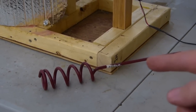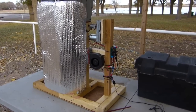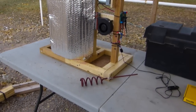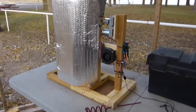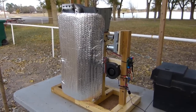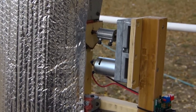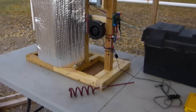These augers run counterclockwise, so you're going to have to hook the motor up backwards — just switch the polarity, put positive to negative and reverse the connections, and the motor will run backwards no problem, operating the auger perfectly. I had this stove loaded up with about four pounds of pellets and ran it for two hours and it easily chugged through them. Pellets are pretty hard to push, so the coupler has to be really tight. The first one broke a couple times until I put in aluminum inserts, and it works great.